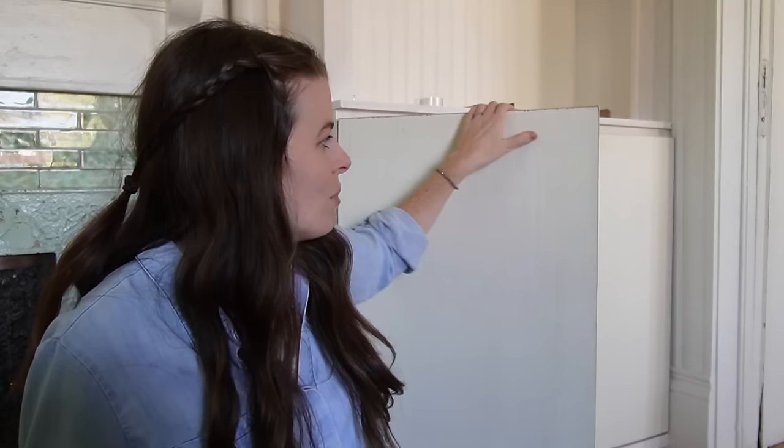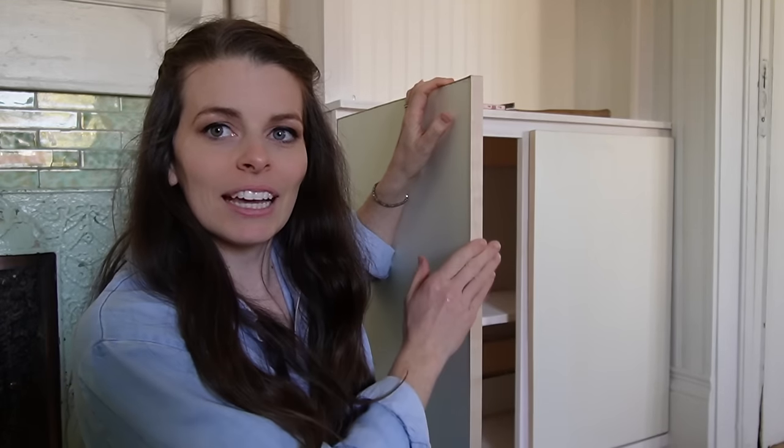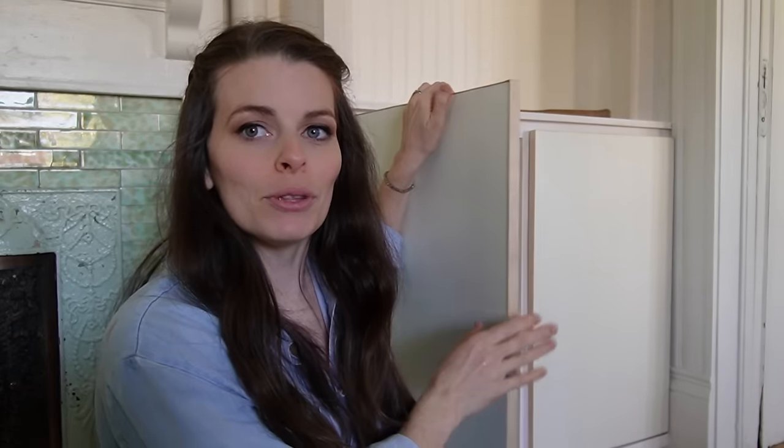Okay you guys, it's the next day. I figured out the door situation for one side — I think I just had to buy new wood for the other side, unfortunately. But I didn't do all this work just to slap it together at the end, so I want to make sure it's right. My tip, you guys: cut your doors and put them on before you do the edge banding, because the door that I already edge banded I now can't use. So it was kind of a waste of materials.